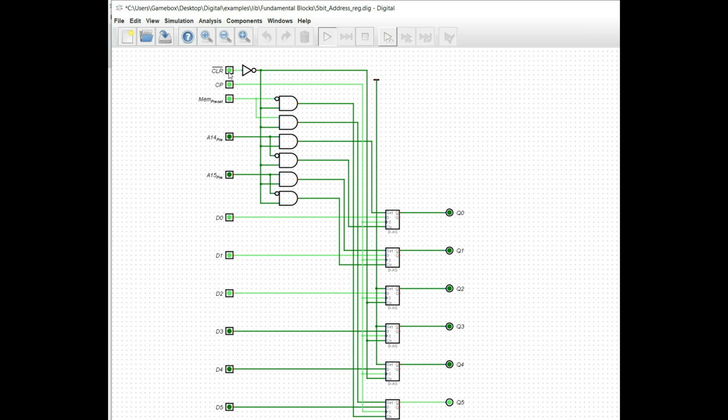And what I mean as a flag is, in the larger block diagram of the memory mapper, this signal here is going to be used as a reference for the decoding logic to determine whether to activate the SRAM or the ROM. So if we set this to a 0, then when we reset the system it's going to end up in ROM, or if we set it to 1, it's going to end up in RAM when it goes to access this.